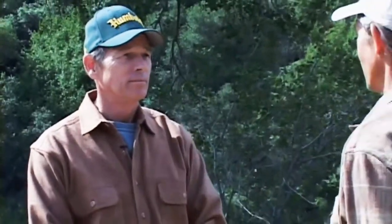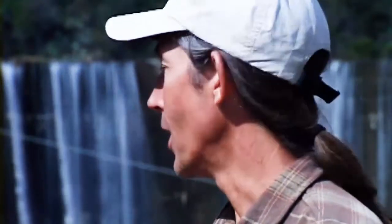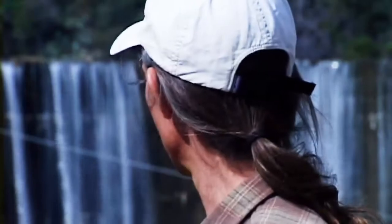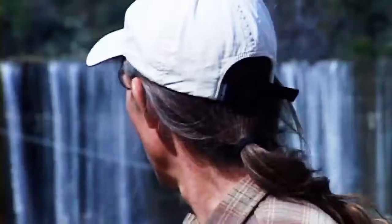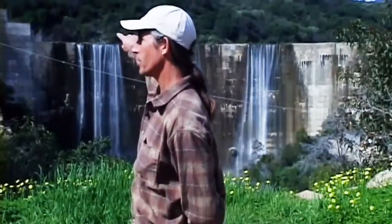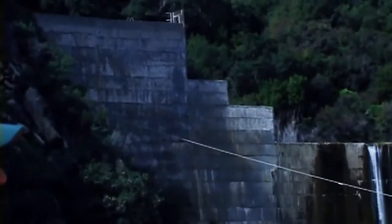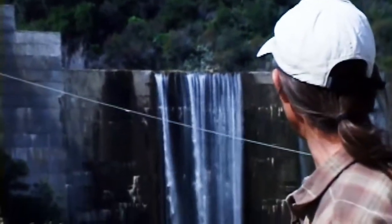Actually removing the concrete would probably be about a year's worth of work. The real problem is the sediment that's built up behind the dam — that's where things get complicated when you have development downstream and water infrastructure downstream. The top rim of the dam is about 165 feet above the creek elevation. The original height was 200 feet, so it was a 200-foot dam notched down about 35 feet. If you went behind there, it's probably about 150 feet deep directly behind the dam, but there's less than 15 feet of water — it's a kiddie pool.